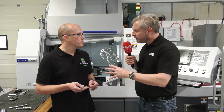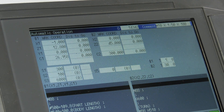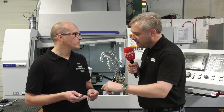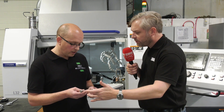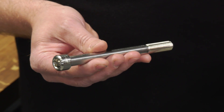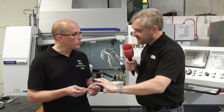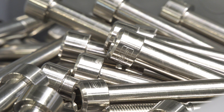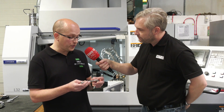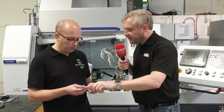It has a Mitsubishi control, which optimises the machine — it's a very quick control that complements the machine very well. In terms of the component, it's a long part, but there are no concentricity problems: the sliding head technology maintains accuracy all the way along. We're making bolts up to about 200mm at the moment, and they're all essentially identical — the program for the thread and for the head is exactly the same; only the shank extension gives you the variation in bolt length.